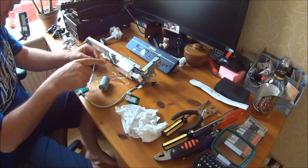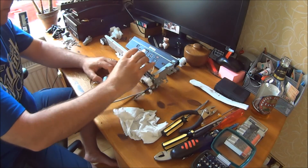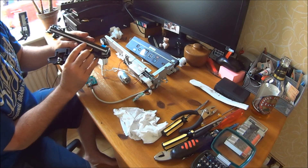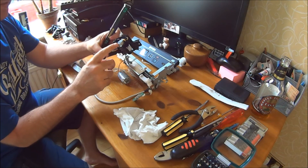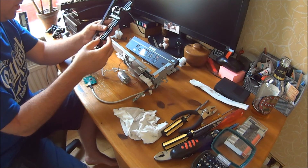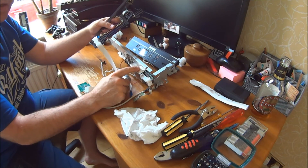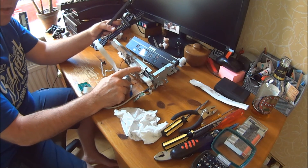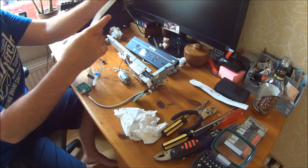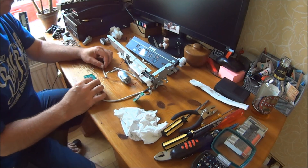This was little LEDs or something, so I'll find out where that's been driven from — I can see it on this side over here, it's just plugged in right here. There are a couple of good things to get off there. And then of course we have the strip light for the scanner, as well as a stepper motor. We know it's a stepper motor because it's actually got five wires coming in there — those five wires are connected to these five wires of this ribbon, which goes across and connects in there. So we know that this thing has a stepper motor driver and some sort of circuitry in there for that. That'll be useful if we want to use that stepper motor — we'll probably drive it that way. I'll leave most of that intact because it just could get damaged otherwise. And then we still have the glass from the scanner, which could come in useful as well.